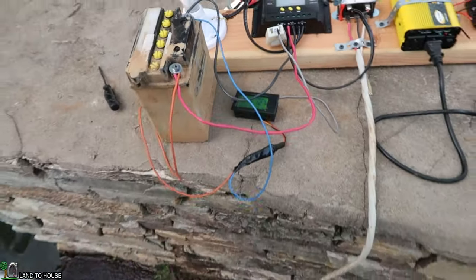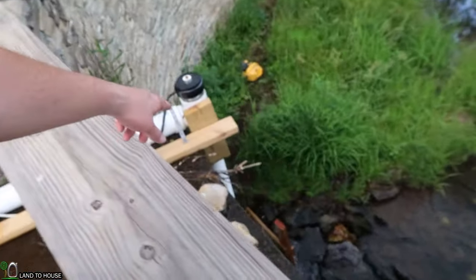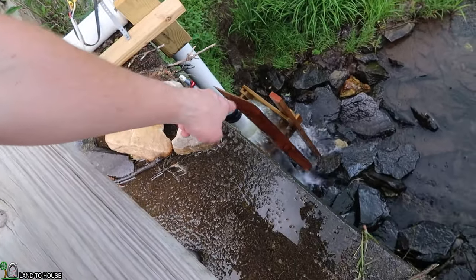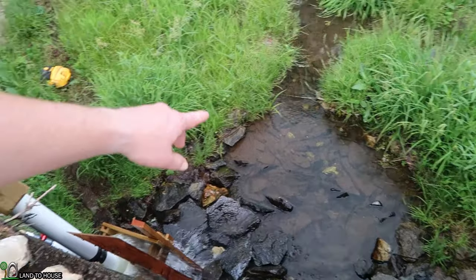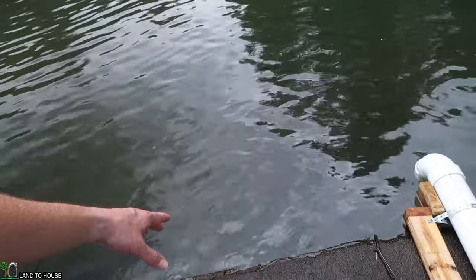So that means that our volts coming in is not high enough. And from my understanding, there's a few things you can do to increase that. Make the down pipe longer, so we could take our bucket out and move down another, I don't know, 4 or 5 feet. Or we could jut over and go to that water over there, and that would hopefully increase this significantly. It's gonna pull more water that way, which means, as you can see, it has pulled down my source pretty good already. But that's what we're here to test out.